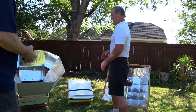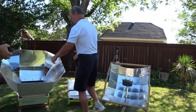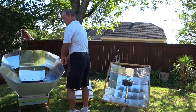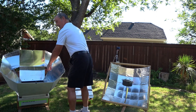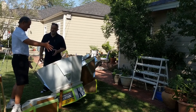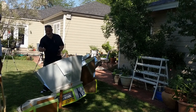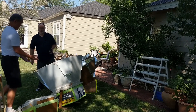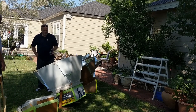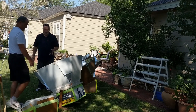What I've done on these box cookers is a dual angle — to get the larger solar collection area, this upper panel cants inward a bit. That's to prevent overshoot, where reflected light would hit the other reflector rather than getting into the box. The dual angle allows you to have more solar collection area without the losses of overshoot. If it were perfect it'd be parabolic, but that achieves about the same results much more easily than trying to produce a parabolic shape.